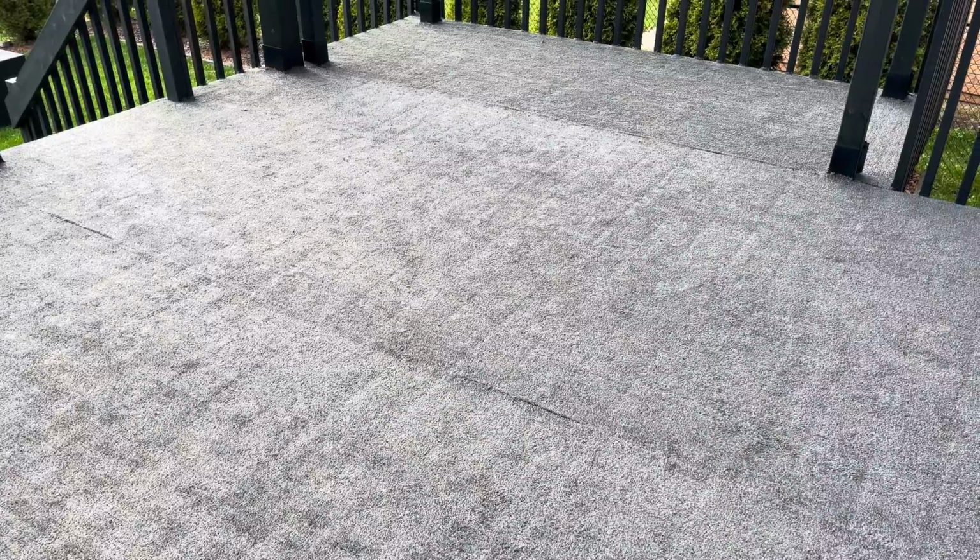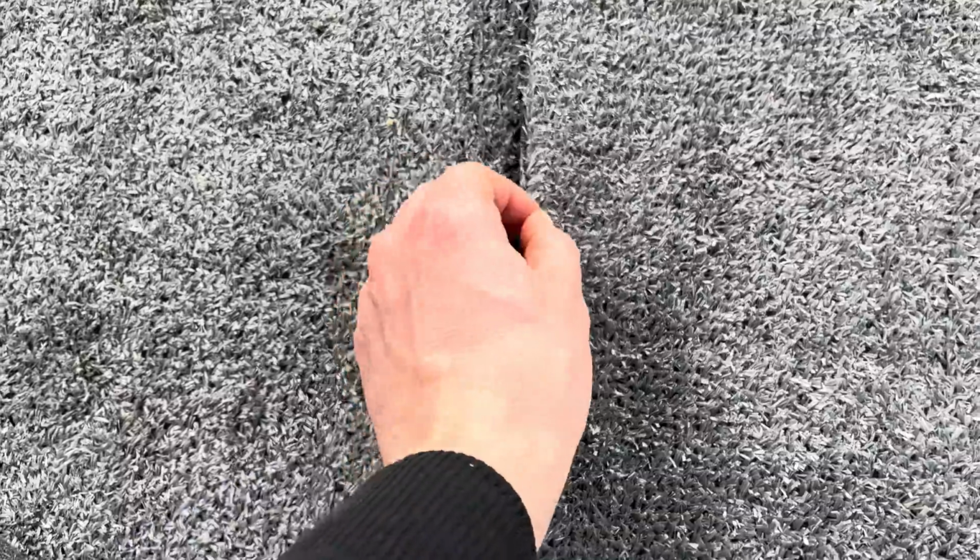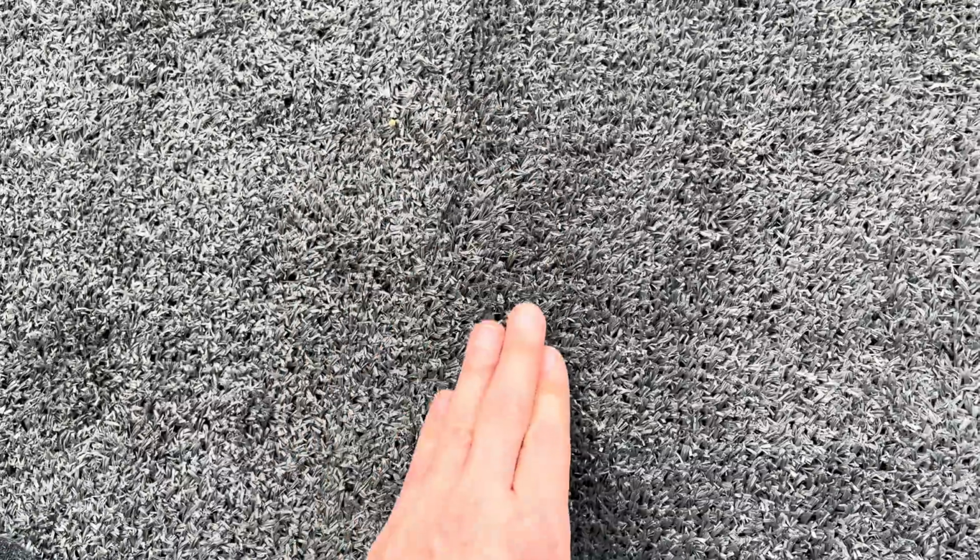If you aligned the carpet very well, normally you don't have to put any type of adhesive, but if you're going to have a lot of people passing by these areas, it's better if you put some adhesive or glue on the border so the carpet doesn't lift up.